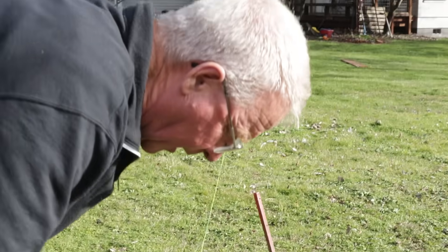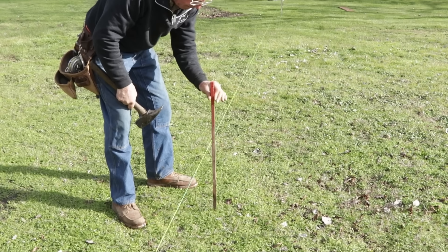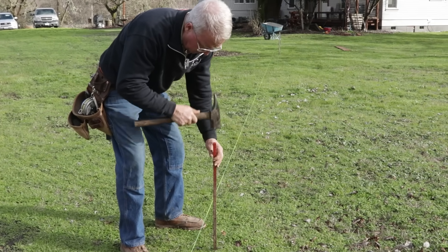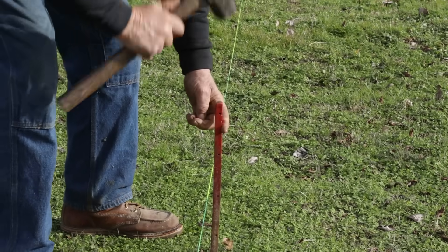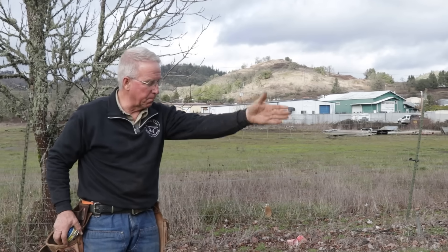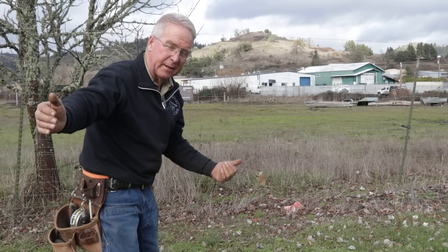Pretty arbitrary, but that's okay. The thing we're going to do now is drop back to where we think we're going to want the end of our rectangle to be. I'm going to bring this lined stake over, letting it hang plumb, until it touches the string. I'm going to drive it down, keeping it in gentle contact. The reason for that will become clear in a minute. Here's a bonus for using a square stake — it'll cut a line. With the baseline in, much longer than we need it to be, and with the string on the outside of the stakes, we're ready to jump across and get a rough width on the parallel line that matches this.